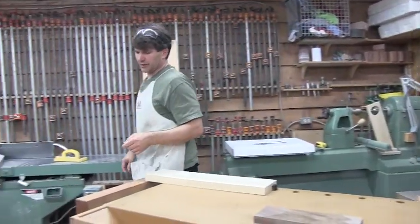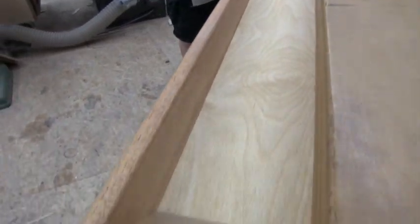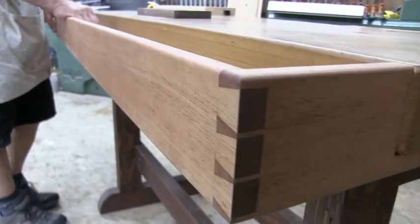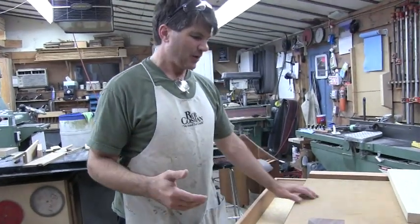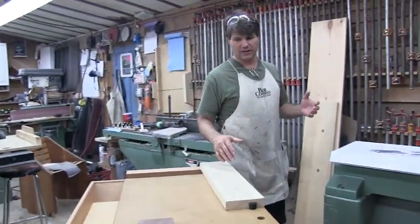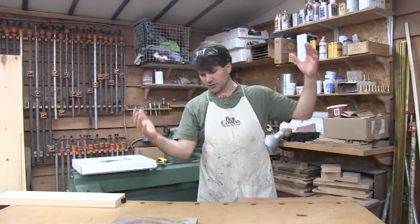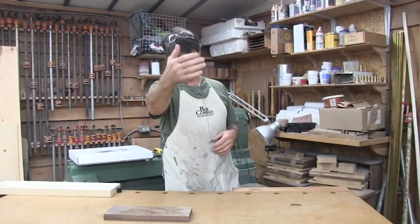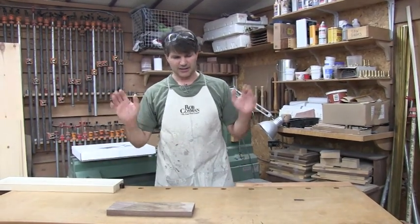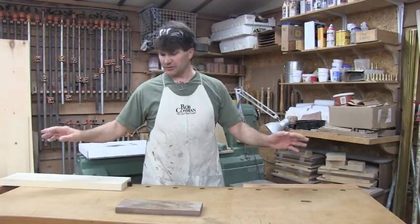I like a tool tray — I'd much rather have my tools dropping into a tray than onto the floor. So we made one from mahogany, dovetailed it up, used three-eighths inch Baltic birch plywood for the bottom, and screwed it to the underside. The reason it's removable is that if you want to convert this back to an assembly bench — for example, gluing up a chest of drawers on its side — you can use the bench top as a big caul and hang clamps on each side. It wouldn't take 20 minutes to remove the tool tray and both vises.